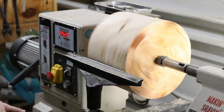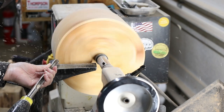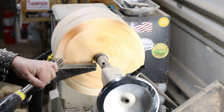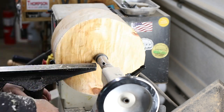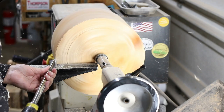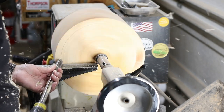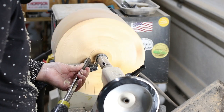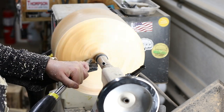Now, this wood is extremely wet. I checked it with the moisture reader, and the moisture content is roughly anywhere from 22 in certain spots to 30%. So I am expecting it to shift and probably warp, crack, whatever. I don't care. I want this piece to turn the way it's going to if it was drying naturally.